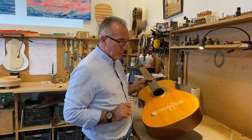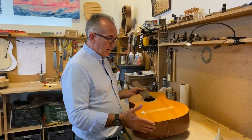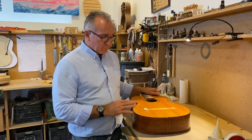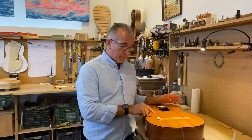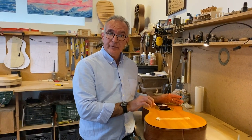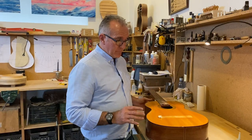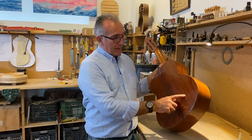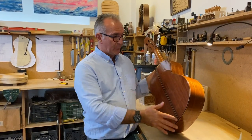If it was my guitar, I would cut it back very lightly with very fine sandpaper to remove all the dirt on the soundboard, and it will also help to level up the two sides of the crack one hundred percent. Then just do some polishing on top and that will make the whole thing really tidy and the crack would be pretty much invisible. This technique — squeezing the glue and using magnets to position and stick the cleats — can be used anywhere on the guitar, even on the back, without needing clamps.